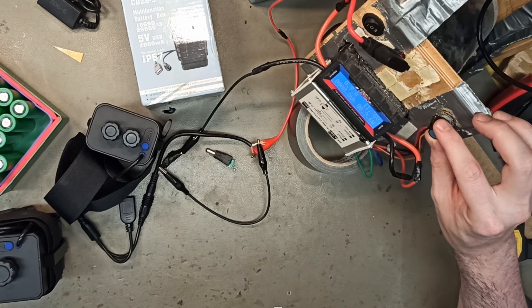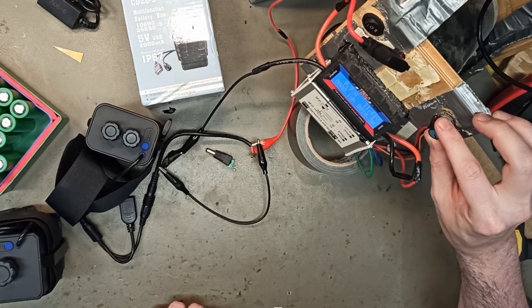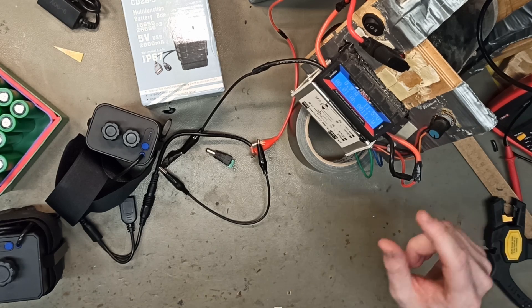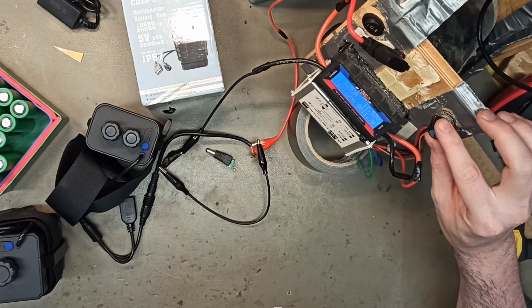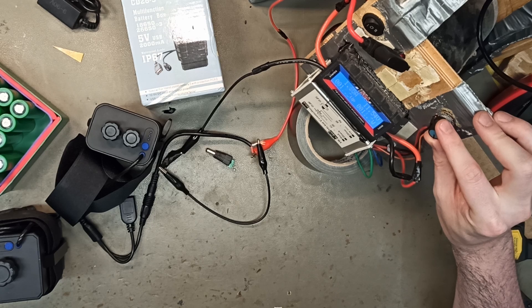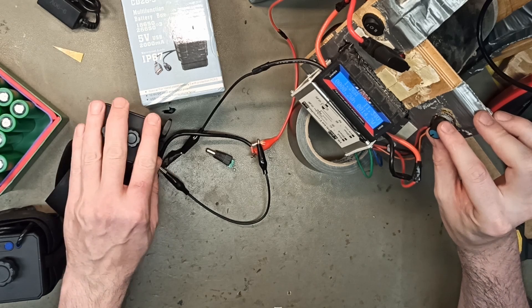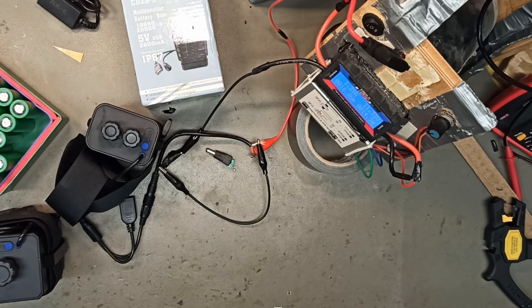You should really not run a motor from a battery pack like this. At about 0.5 amps it's slightly below 12 volts. I'm feeling if it gets hot — I don't think the cells will get hot but the electronics will if they're exceeding their capabilities. Now at about 1 amp the voltage is 11.5 to 11.6, which is still very acceptable. Some other 12 volt DC packs I've seen go down to 7 or 8 volts at less than one amp. At max current it's about 1.3 amps and still has almost 11.5 volts.